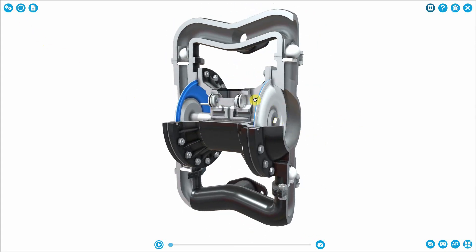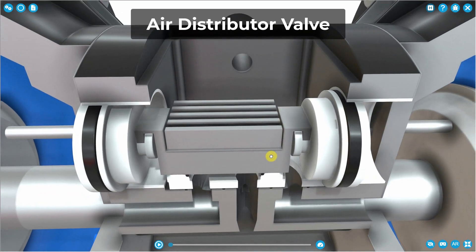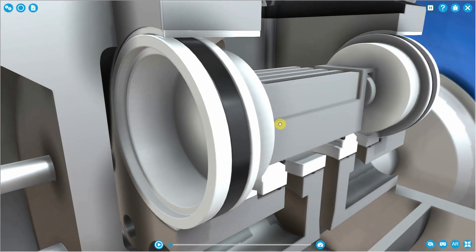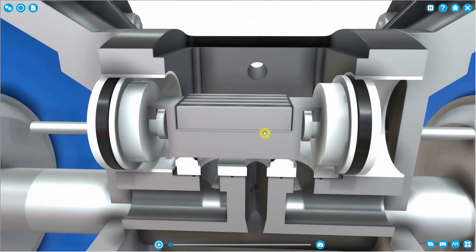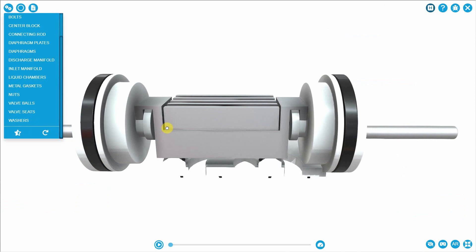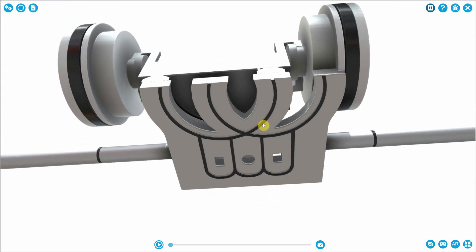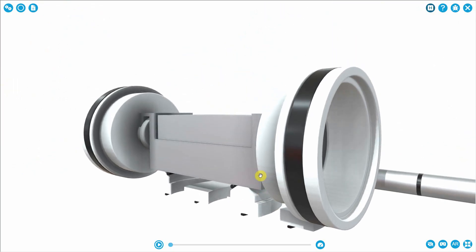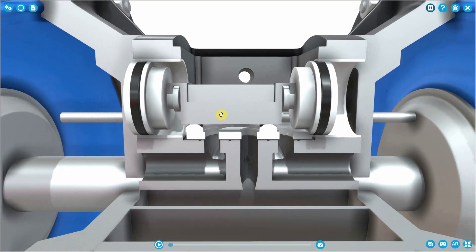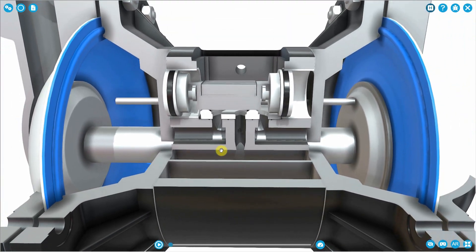We'll take a cross section and now you can see that we've got a good look at all of the internal parts. There's a main air distributor valve — that's this whole assembly where the block is, here where this piston is, and at the opposite end. This valve is sometimes called a distributor valve or center block; there are a few different names for this piece. Notice there are a lot of seals underneath the air selector valve — those are important. There are also seals on either of the pistons, indicated in black. We're going to use those seals for restricting the flow of compressed air within the center assembly space, which is the space roughly between where these two orange lines are.